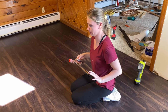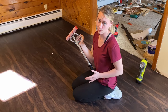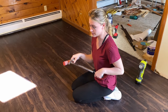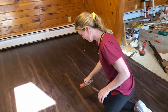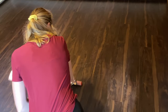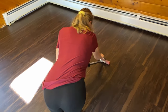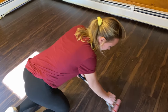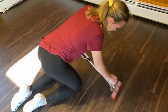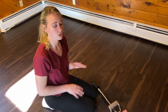You're going to want to roll the floor. They recommend a 75 to 100 pound roller, but we just picked one up for about $20 on Amazon. The only con is you've got to be on your knees and put your weight into it, but it's better than buying a super expensive one or renting one. Start by going with the pattern — longwise with the grain — and then once you're finished, hit it going across the grain. You can really push into it; you're not going to hurt the floor. A lot of these glues are pressure sensitive, so the bonding happens at this point, which is why it's really important to make sure you hit all the spots.